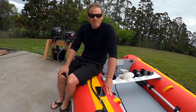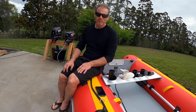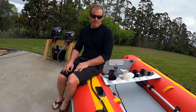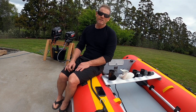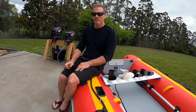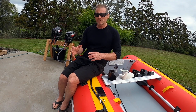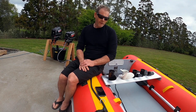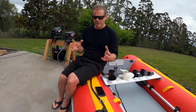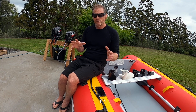We're back at headquarters now. Unfortunately the battery in the GoPro ran out so we missed out on the last few tests, but I'm just going to give you a little wrap-up of what we learned today. Every time we do one of these testing sessions you're always learning. There's so much to learn about the performance of boats and how each boat interacts with the engine, the propeller, the load in the boat, and the sea state. The conclusions were that our boats in particular — but probably all small boats — love a propeller with quite a bit of shape in the blades. The cupping on the trailing edge makes a big difference.